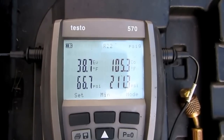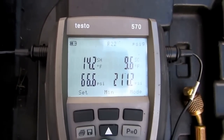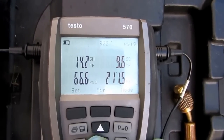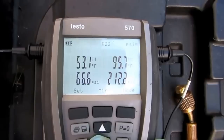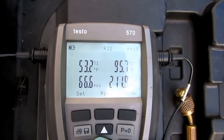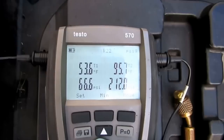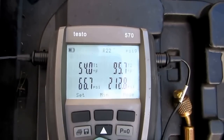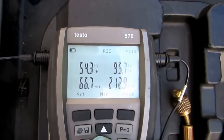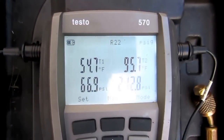Go with what you think is best. I'm happy with this charge. Before I had zero superheat and 38 degrees subcooled — crazy. My suction line coming back was like 38 degrees, now it's like 50, almost 54. So that's good right there. If I try to get my superheat any higher, my suction line is going to be coming back too hard. That's going to be it — but that's good there.